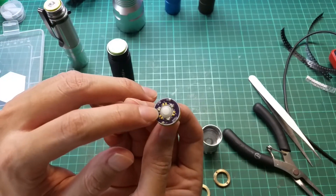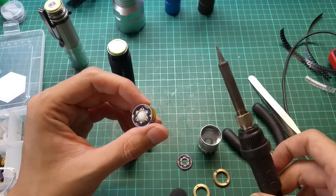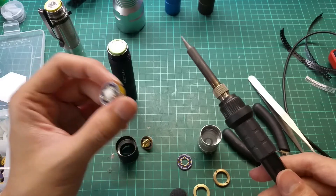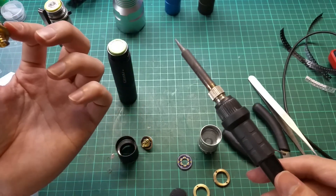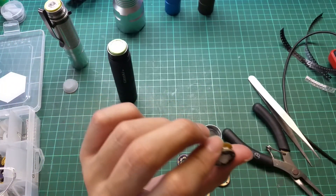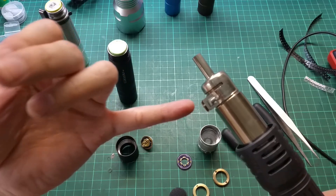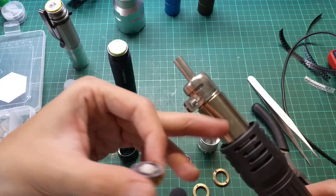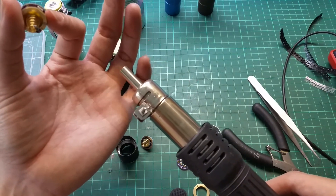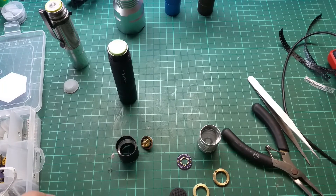As you can see it's actually quite easy but a bit fiddly if you've never handled SMD components. You definitely need a soldering iron — this is my cheap Chinese temperature-controlled soldering iron. If you have a JBC it's much better. I also found that a hot air reflow gun is quite useful for soldering SMD components, but the regular iron method also works.